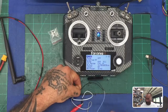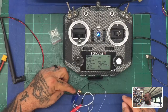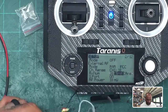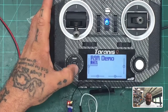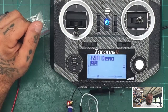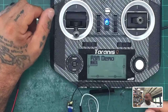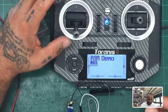As it's chirping, hold down the bind button on your receiver and apply your power source. You're going to see two lights automatically: a green light and a rapidly blinking red light — that means you're bound. Hit your Enter key on your controller, then exit all the way out to your main screen. Now turn off your receiver, wait for the power to go out, then turn it back on. You're going to have a blinking red light that then goes green — and now you have telemetry and you're bound to your R9MM module.